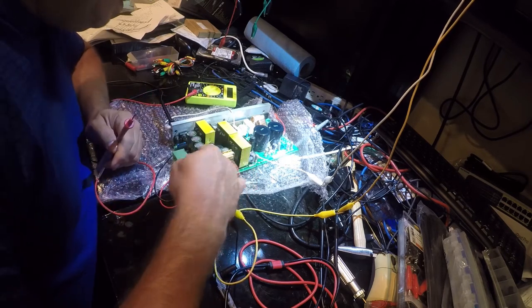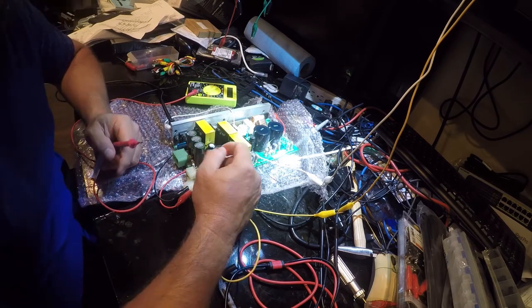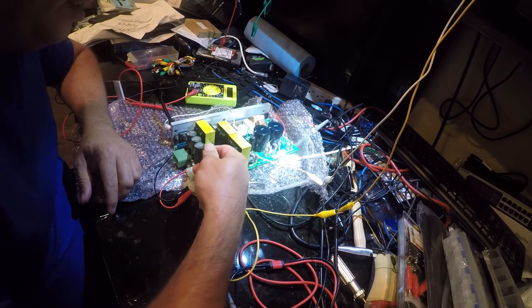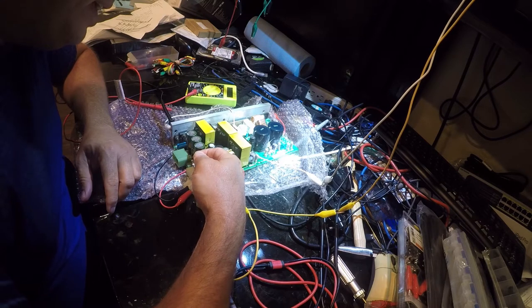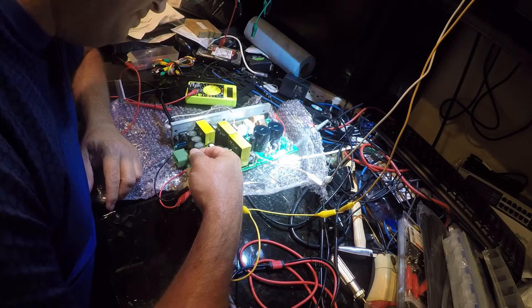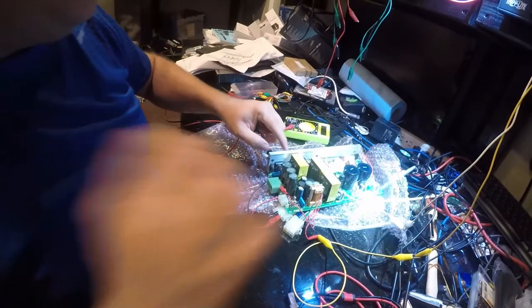Oh, we're shorted again. That's interesting. So upstream of this, I have 3 volts, and downstream of it, I can inject 3 volts just fine, but upstream of it, I get nowhere. And I do mean nowhere, like my power supply shuts down. What happens is this light turns orange, telling me I have a fault. So let's disconnect this and give it a little bit more current.